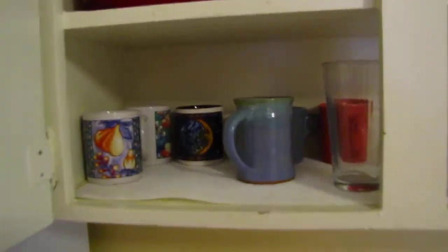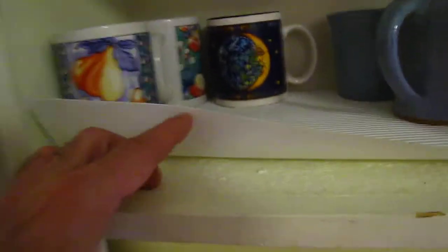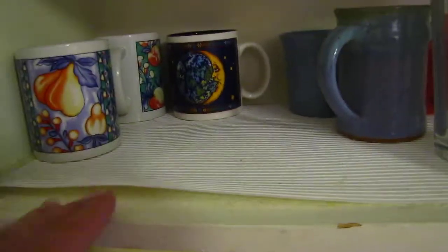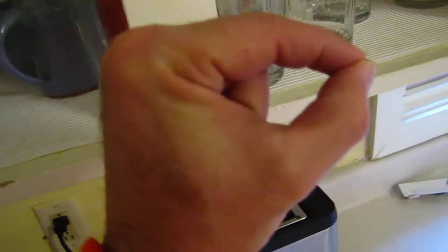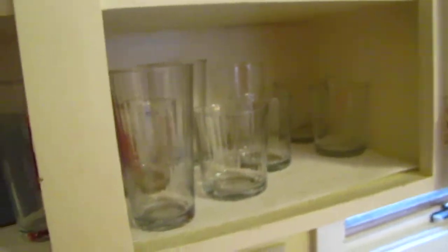It's a standard cabinet, no frills. I wanted to show you the surface they're unhappy with. If you look at the base — see that — they don't like it being rough. So what I was thinking is an orbital sander to get the big part. And you know it's round, so you're going to have the corners to sand with something pointy. And that thing that would be pointy would be the multi-tool with a little piece of sandpaper. I think we did that on the deck that day, so that we can get the corners.